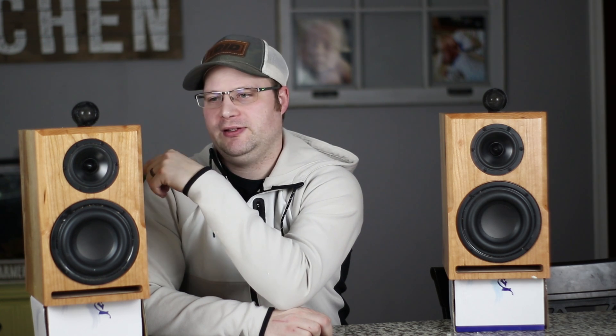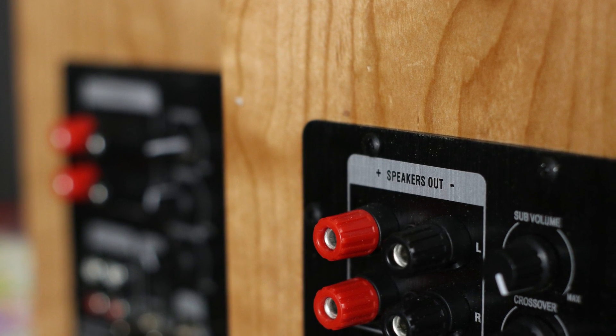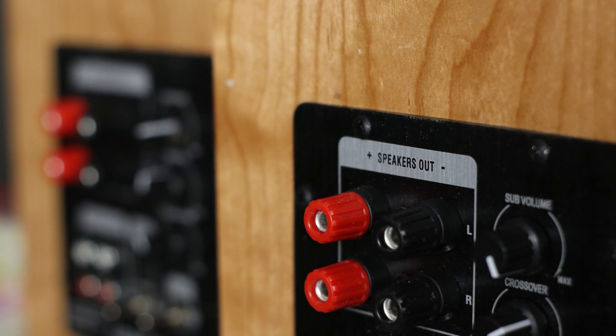The $1 capacitor wires in-line with the tweeter and solders to the back of the amplifier. However, if you don't know how to solder or don't want to, you could leave the tweeters off — they're just topping off the very top of the high end. You could just wire the midranges to a binding post in the back of the speaker and run a small speaker wire between that binding post and the binding post of the LP-210PA. That way, you won't have to solder at all.